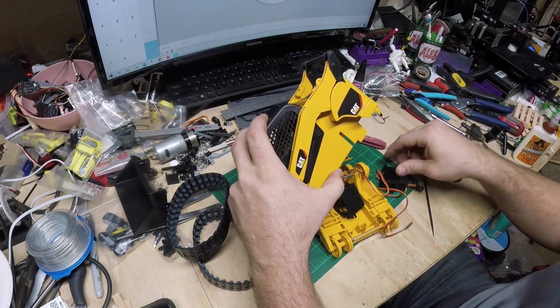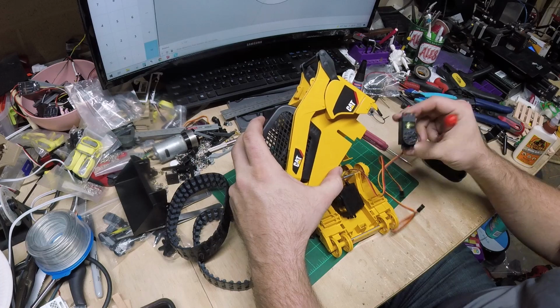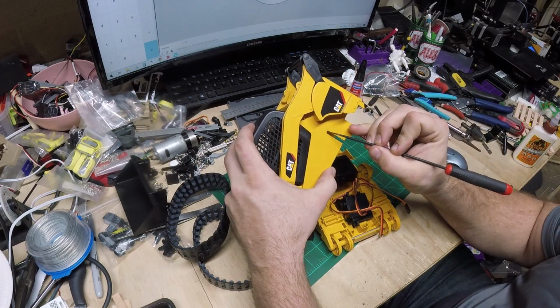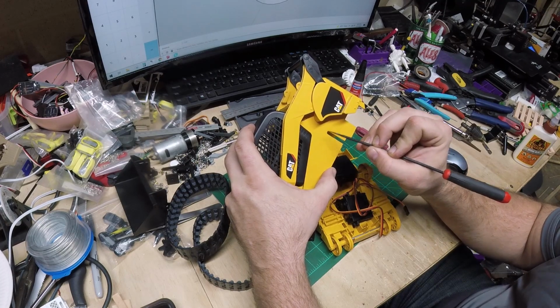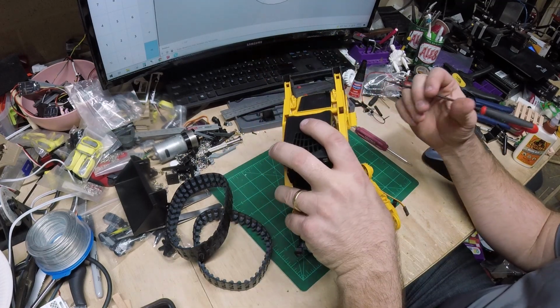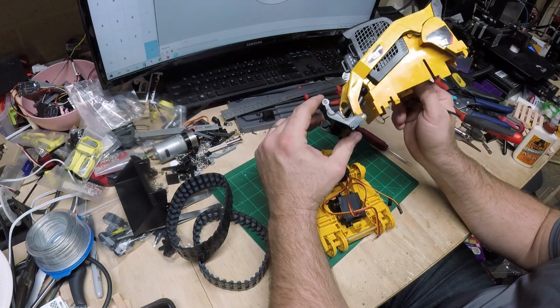Like cut the square out right here, where that imprint will lay, so that the center of the servo comes right out that hole right here where that axle needs to be. And then probably have to add a couple little spacers on the backside to get it spaced out right, and then just put 4 screws holding that servo here and there. And then when you set it back on, you can put the tracks on. So that's my initial thought. That's kind of my goal.